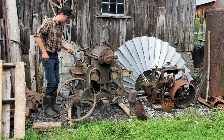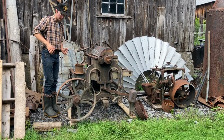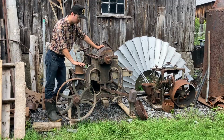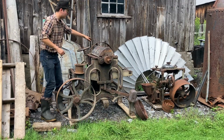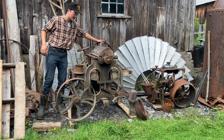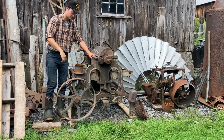There's a strange idler set up on this side to tension the feed. Most of these had some sort of a pull tensioner that you could shut the feed off while the knives were still running. Not sure about this one. Anyway, that belt would go down, go across, and then go back up to this, which would feed inwards. And this shaft with this pulley is a little bit bent, but it should be all right. So we'll try to run it without tinkering with that yet.